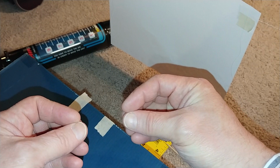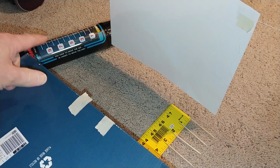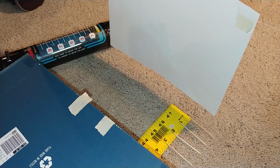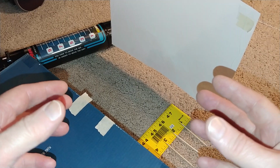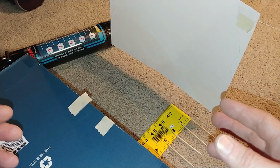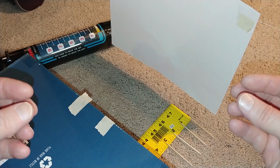So if you've ever seen a Baird meter, and I put this off to the side just so you can hopefully zoom in and see this, it says you have to move the air in order to move the dirt. I put the Baird meter there as a reminder that once the dirt is actually mixed into the air, or a volume of air, the faster you actually move it, usually the better you're going to be able to clean, or if you don't clean better, you can clean faster because the dirty air is moving much quicker.